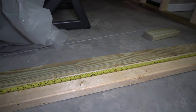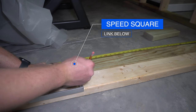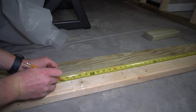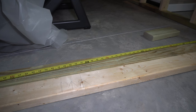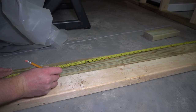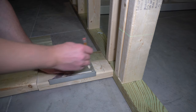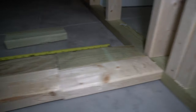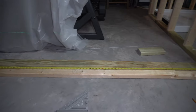It's important to notice that your stud is going to be on this side and this side over here. So take a square to mark those stud locations. These are our two stud locations for the door sides. And back at the corner where we started, we'll put a stud on the end and mark out those two stud locations there as well. So we have 38 inches between the door stud marks. Now we know where the door is going — double studs on each side of the door opening.